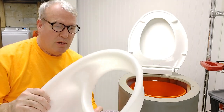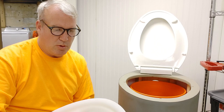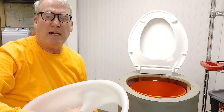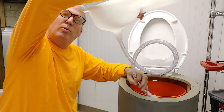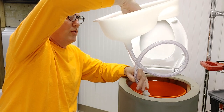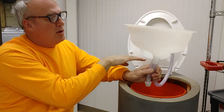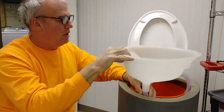I can dump this on my property, and I can fill up my gray water tank — I think it's 35 or 40 gallons, which is probably almost a whole season, maybe half the summer. Instead of having this go directly down, the sewer gas from what is now effectively a gray tank would come up through the line. That's why I'm going to loop it using a drip loop — gravity will siphon it down and there'll always be a little liquid in the line to keep gases from coming up.